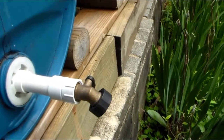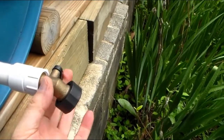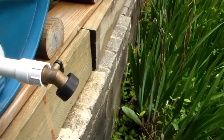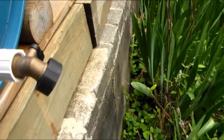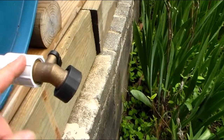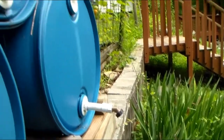The valves on the chicken's water system are around three and a quarter to three and a half dollars depending on size. These on the storage barrels are simply angled valves for a water hose — the kind you'd have on a sprayer — with a little ball valve and a lever for simple shut on/shut off. It's a three-quarter inch hose fitting, kind of in backwards from the way you'd normally see it, but now I have a valve on each tank so I can control them individually.